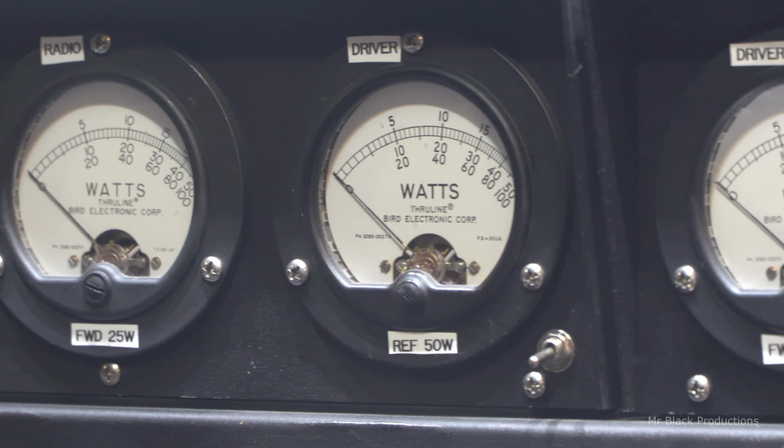And we're going to continue on, and I'm going to show you that the last thing that you want to have touching your charge lead is the super cap. So if we end up adding a battery or something, you have to take that positive lead and run it over to the battery and then bring it in line. But there's enough room for us to put probably a whole other cap in here plus the 24 pill. But since I got a 32 out there running on three super caps in a single 300 amp alternator, I don't think we're going to have any problems.